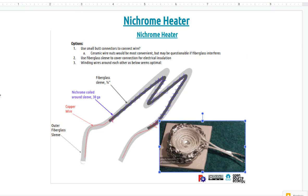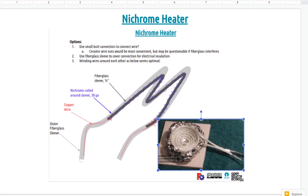I think it's definitely more about amperage than voltage here. For instance, a system that melts aluminum ingots in the aluminum process, for turning alumina or smelting it, is 3,000 amps at 5 volts, something like that. So really here it's about pushing more amps through a wire. We can get a higher heat and avoid larger gauges of wire.